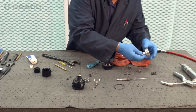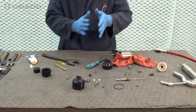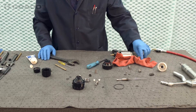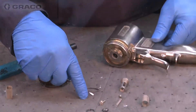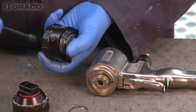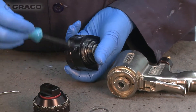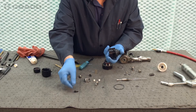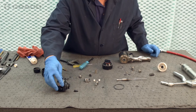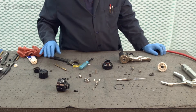You can see that spring that holds the tension against the threads to keep the rod in the proper adjustment. This will have the O-ring here for the face because we have clean-off air. It's like a needle valve assembly — there's a small O-ring there. That blows air across the cap to keep material from adhering to the cap while we're in the spray process.